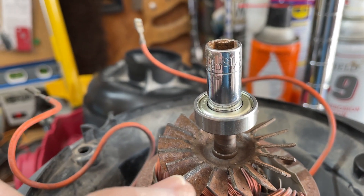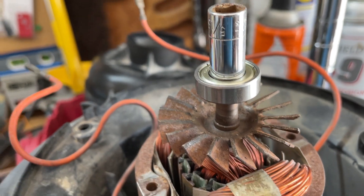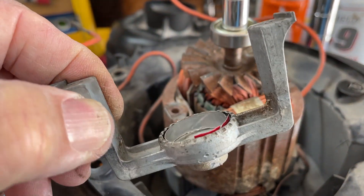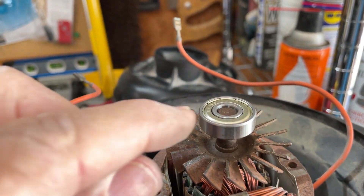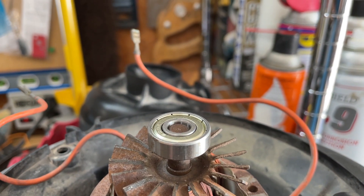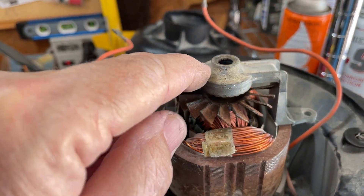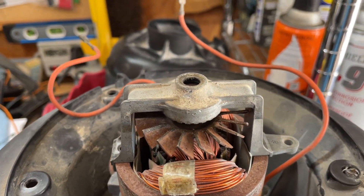I changed my mind — I'm going to go ahead and drive that bearing onto the motor shaft with a socket, applying the force only to the inner race. Then I'll see if I can get my carrier with the boss and the shim onto the outside of the bearing. I drove it partway on; it's going so easily that I'm going to put the boss on with the shim and put it the rest of the way down. That went on super easy — just a little bit of friction, I was able to push it home without even tapping it with a hammer. So I put no undue force on that bearing at all.